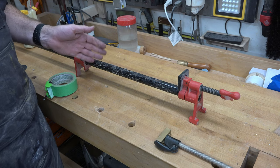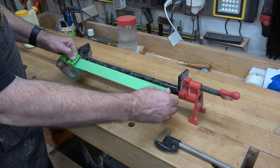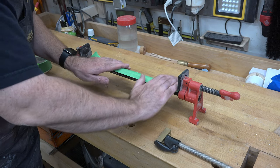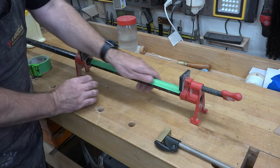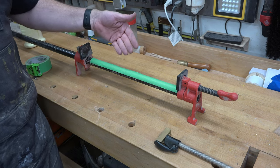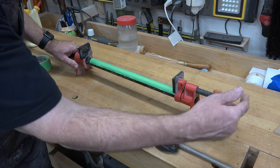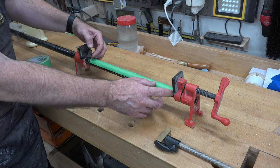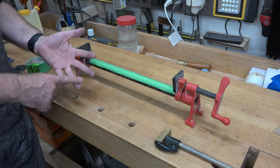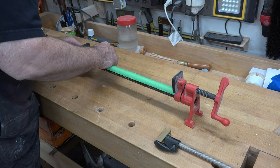So how can you avoid that? Masking tape — that's all it takes. Measure or know what the final clamping distance is, then about an inch less than that peel off some wide masking tape and lay it on top of your clamp and rub it down. This does two things: it gives you a protective barrier between your work and the black iron, and a protective layer between the glue and your pipe.